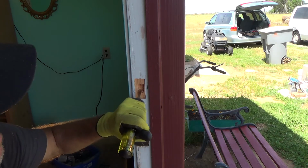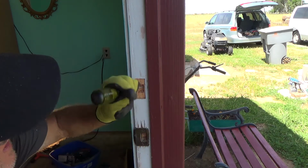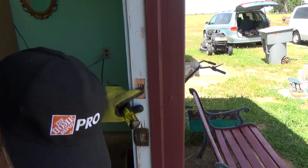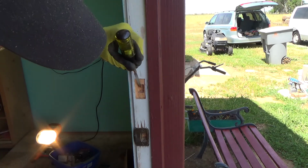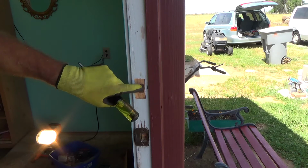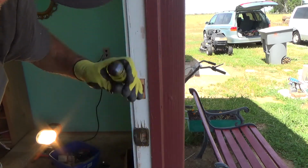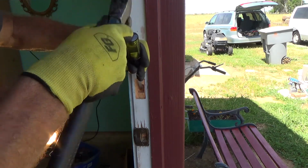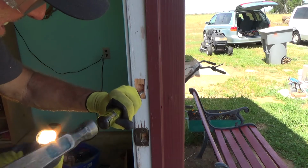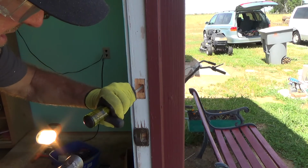Sometimes people don't do it, and even professionals forget to check that, and they throw the deadbolt, but it looks like the thumb turn's not done all the way, and you pull it back out and check it with the door open, and son of a gun, you can push the edge right back in because they didn't have it deep enough. So then you're going to have to be the one to check that. And then if you want it deeper, which I would highly recommend, you're going to chisel it out a little deeper with the drill bits.